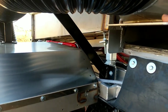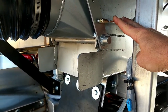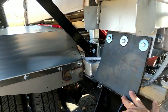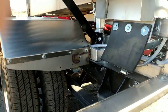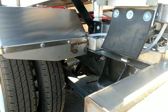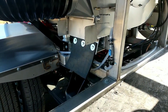You can also use this as a blower and blow to the side. Moving it by hand — all the way closed. You can see the cable on it right here; this is our standard throttle cable that we've used over the years, so very simple. There's a little deflector on here to keep the dirt off of the sweeper, and a sprayer underneath here to run quite a bit of water if you're concerned about dust — it's like a pressure relief or a vacuum enhance. You can use it to blow leaves out in this direction to help your sweeping path, or just use it as a vacuum enhance. It's adjustable so you can aim the spray closer or all the way out.